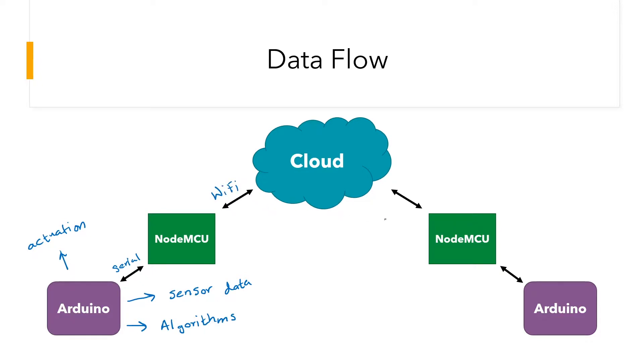On the other hand, data can also be pulled from the cloud onto the NodeMCU and then sent to the Arduino to perform some sort of actuation or run an algorithm. It can be noted that the Arduino is not even needed — you can directly connect sensors to the NodeMCU — but if you have a large quantity of sensors or a large algorithm to run, the Arduino would be preferable. You can also use this method to link systems together in completely separate locations in real time.